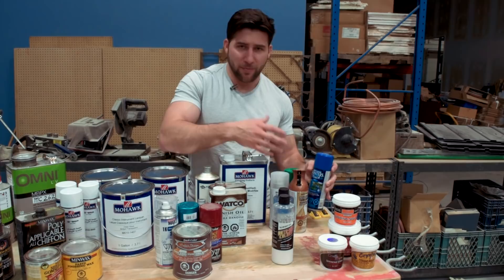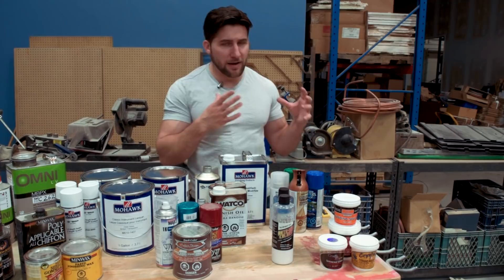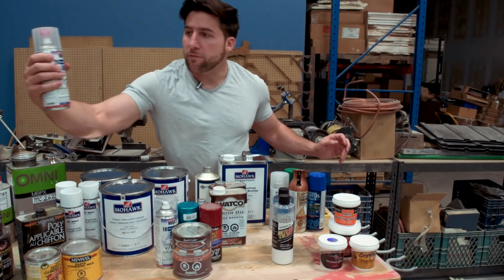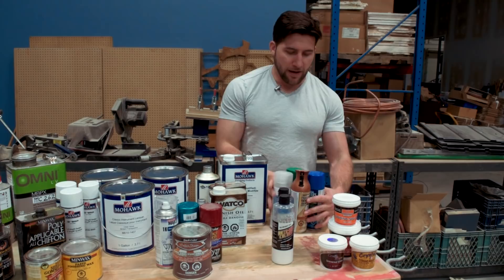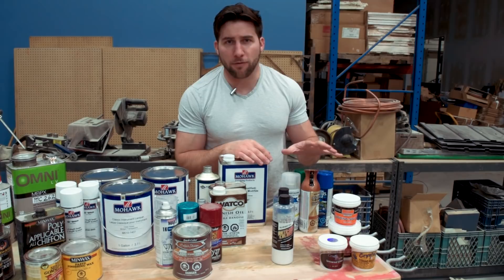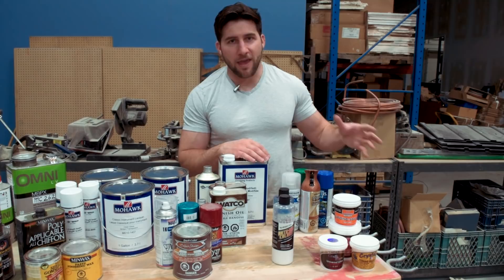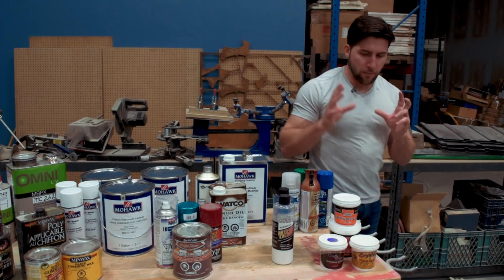Second, they are — I believe — an acrylic enamel for the most part, depending on which Rust-Oleum product you get, which means their compatibility with other finishes is limited. You kind of have to stick within the same system, unless you're going over an acrylic and then clear coating it with, for example, a 2K SprayMax — great option, by the way. Also, if you have the wrong weather conditions, you're going to have a finish that never really hardens properly. That's one of the main complaints I get — finishes that six or eight weeks later still mark up if you put the guitar down on a towel. So you do have to be careful and make sure you're using them properly, but they can work.